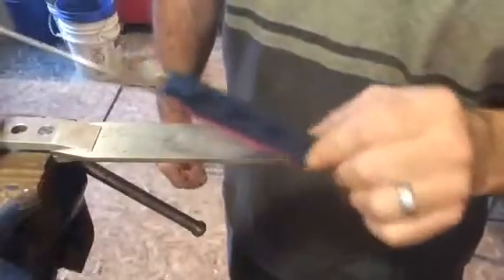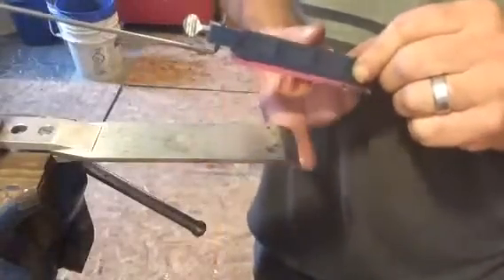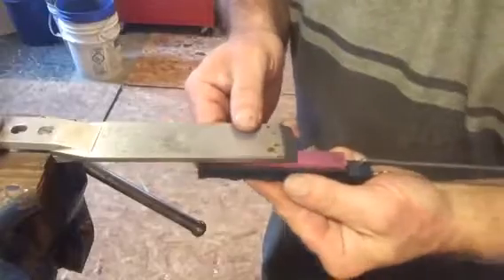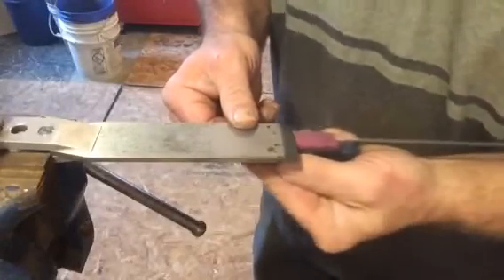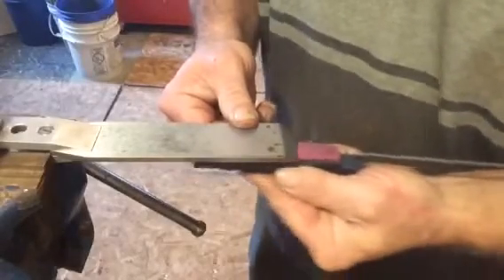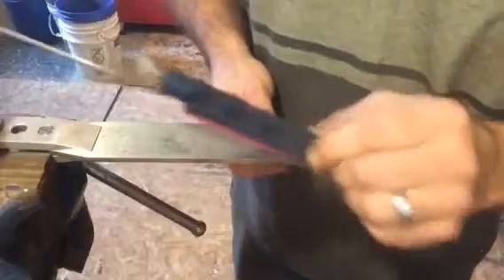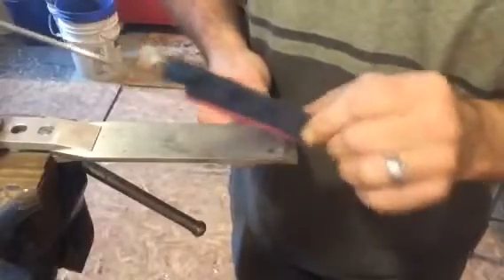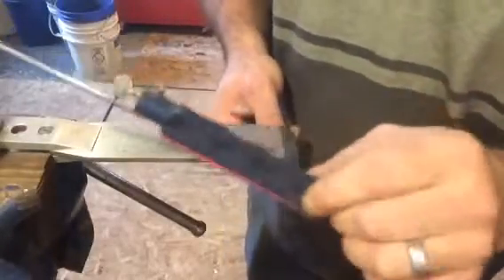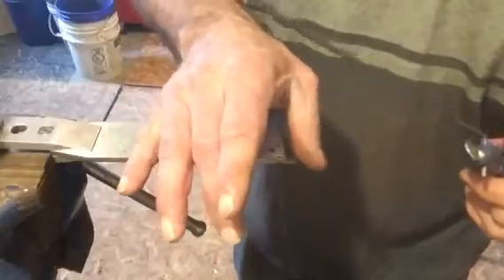Alright, I've been working my way down through the different stones and she's starting to polish up nice now. There's definitely a little burr on the bottom. I simply turn that over and work the burr from the bottom — like that. Pretty simple. Back on top again. I'm not going to bore you with the entire thing — you guys know how to sharpen planes. This is just a great little tool to get that radius properly. She's sharp now.